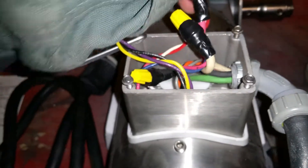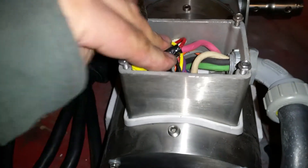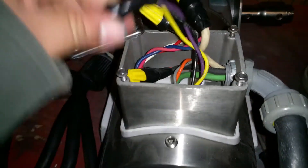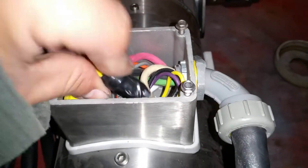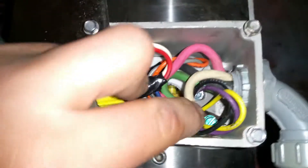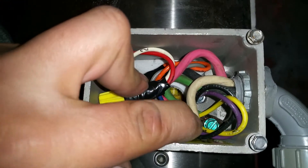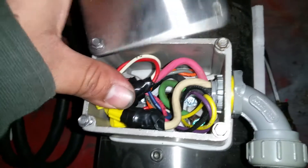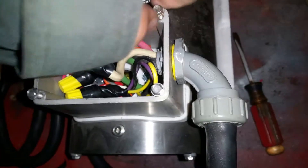That's how you wire a three-phase motor, and now we just stick the wires in here. I like to stick them in with the nuts pointing up this way, so if moisture or water gets in there it does not fall inside — let gravity do its job. There it is. The ground is in here too; I already mounted the ground, and there's the other wires.